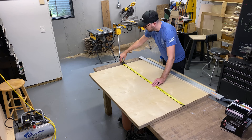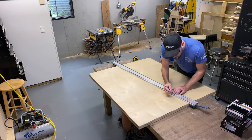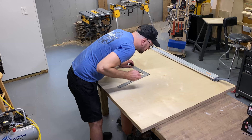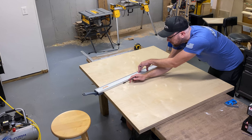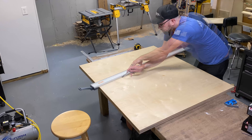I ended up using three-quarter inch plywood. This is actually some scrap left over from the dining room cabinet projects. If you haven't seen those videos, I'll link them here so you can see those. I started off by gluing two of them together so that I have an inch and a half base to put the screws in. For planning purposes, I found the center of the board and then drew out four quadrants from the center, and then started laying out the grid on the wood platform.